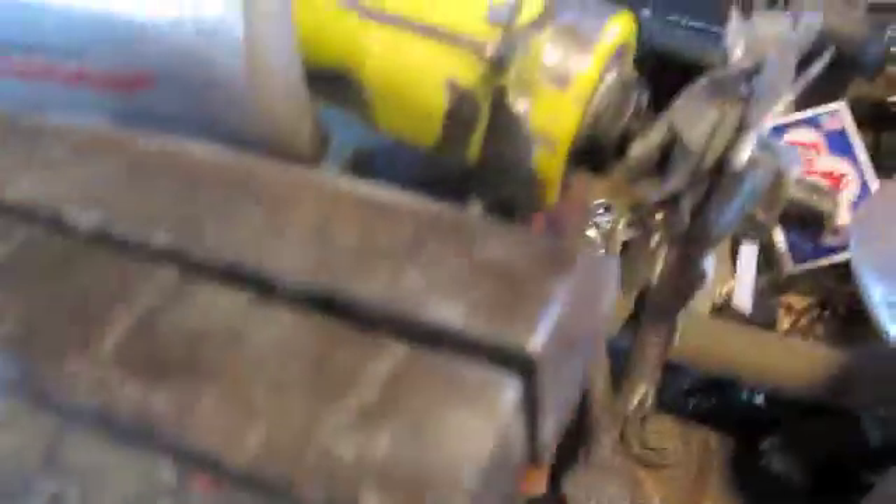We need to put the turbine inside the main engine housing, which is a Coke can with the front cut off and the middle insert cut off with a razor. To fit it in, you have to make four little hole tabs that you bend in — here's a good shot of one — and that will allow you to get the supports in. This is the bearing housing from my bike wheel, and I had to grind away some of the supports to make it fit.